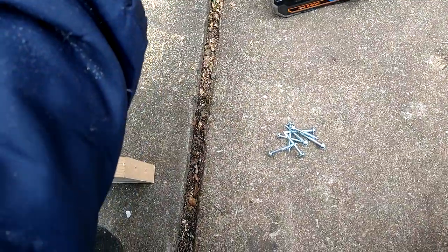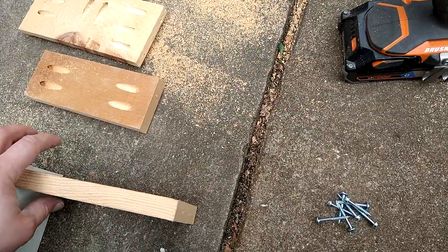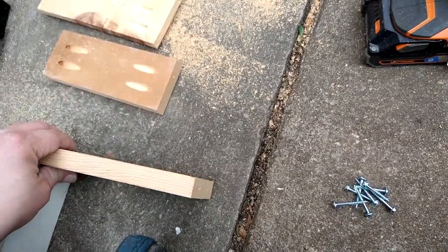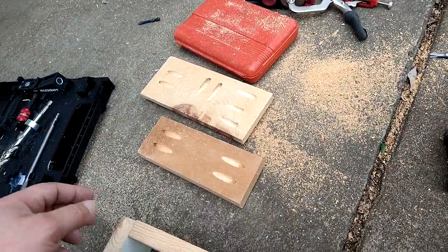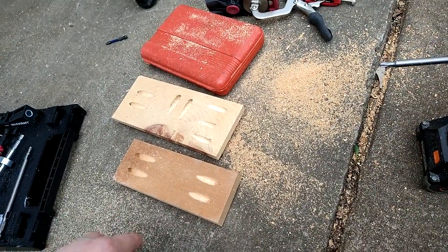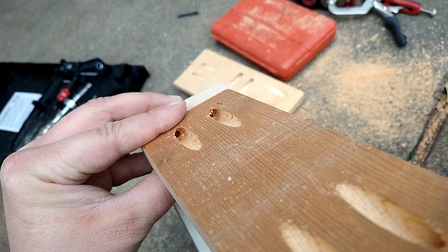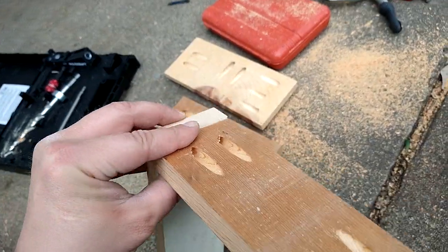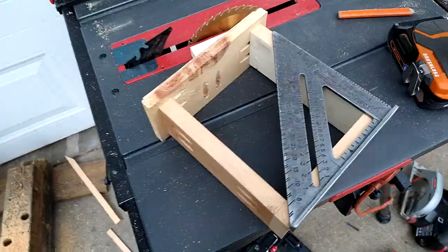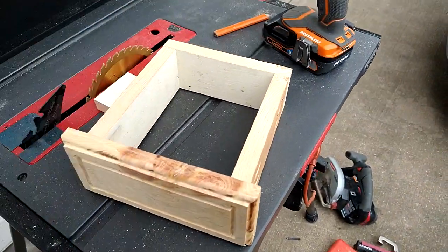Because I'm on an outside angle, I can use the shorter driver — a T20. I'm gonna set these down on the top of the table, try to keep them as flat as possible, and try to hold them with my hands since I don't have corner clamps. They also make clamps that go into the pocket holes themselves and hold the workpiece in place, but in this case that wouldn't do me any good — really what I need is just a corner clamp.